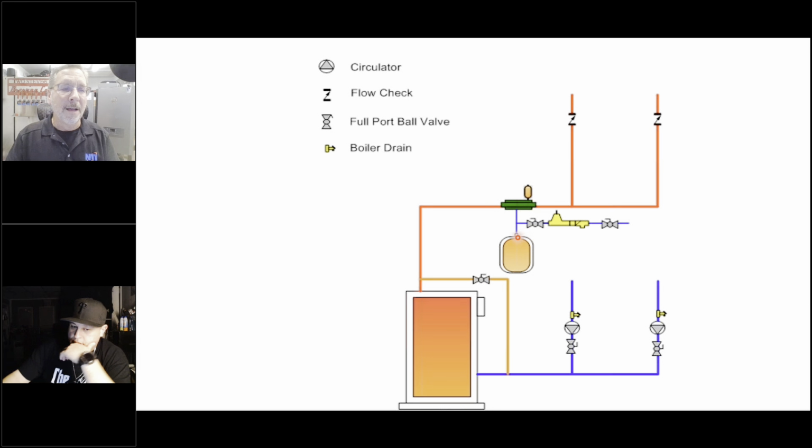I guarantee you. When I owned a supply house, I went out in my warehouse. I had a pallet of number 30 Extrols, the most popular Extrol in my neighborhood. And I tested all 30. And they ranged in pressure from 3 to 14 pounds. See? So if you're not checking the pressure, folks, if it's a 3 pounder and you're putting 18 pounds on the other side, you're going to stretch that diaphragm so far it's going to break.